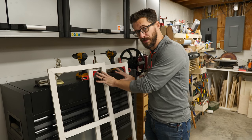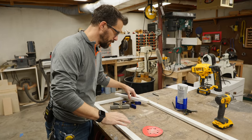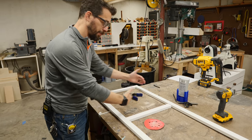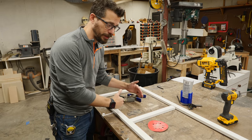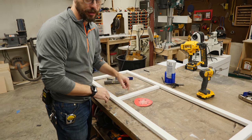I'm making three of these. I've got two of them finished and I want to show you how I'm going to put the third one together. Basically the frame is done, but I need to put in a separator. The separator is going to give me an area to put the shelves, which are going to be hanging on French cleats, and then the big metal sheet. This is just going to go in place with some pocket hole screws.